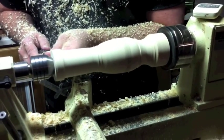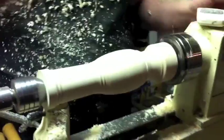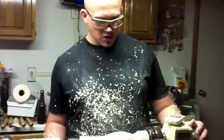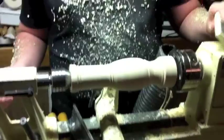And in just a few short minutes, you've got pretty well the shape of a pepper mill going. I've got the shape of the pepper mill done — it's squared off at the bottom and at the top, and now we're ready to do some sanding. When you're sanding, you need to be very careful because you don't want to erase any of the details you just spent your time working on, so be a little bit loose when you come up to those areas. I generally sand the big elements first. When I sand, I always want to have some dust collection — I've got my dust collection tube right back here, and I'm going to turn that on.